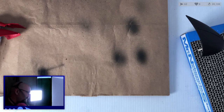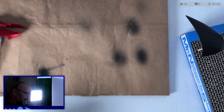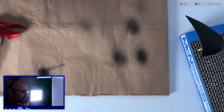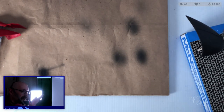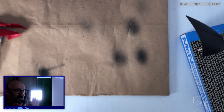The one issue is that you could end up possibly, depending on flow rate and pressure, freezing up your tip, which can cause the spatters. A way to get around that is... yeah, there we go. Iris has it. Air gets cold as it expands from a compressed state, but as long as you make sure that the CO2 tank that you have doesn't have a dip tube and isn't supplying liquid carbon dioxide directly to the tip, the point where the expansion happens, then you're probably okay.